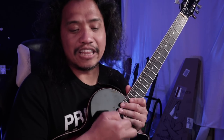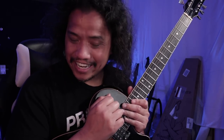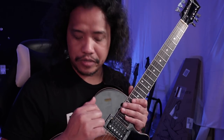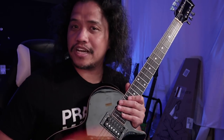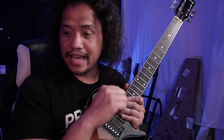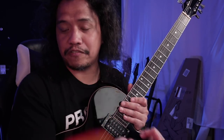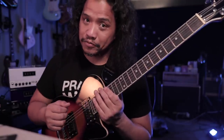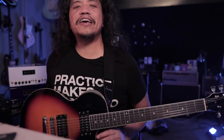So if you bought a DLP-124 to practice and learn guitar tinkering on, then I think it is a worthwhile experiment to dip these pickups in paraffin wax and learn how to pot them, like Eddie Van Halen did to fix his microphonic humbucker. I think that would be a good learning experience. Or you could chuck these out and install your favorite aftermarket set of pickups. That works too. Okay, there you have it.